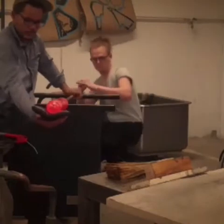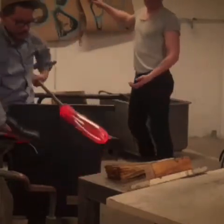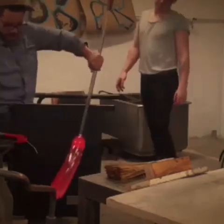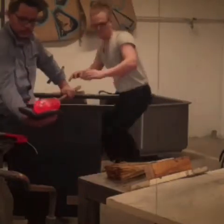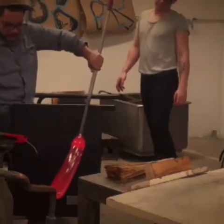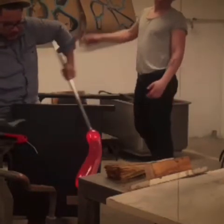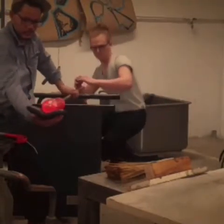I'm going to leave this loop in for a minute so you can watch it while I'm talking. Take a look at the glass — see the way that it's moving. That's the first part of it. It's moving like a slinky where each part is just sort of feeding into the next part, moving nice and smoothly. There's no kinks, there's no corners, and part of that is an even setup. Even thickness, even heat means even movement. The more that you get away from something that's even, the less the forces are going to affect that bubble uniformly — they're going to affect the different parts differently.